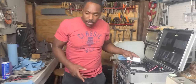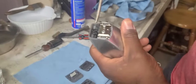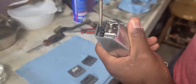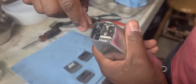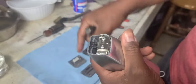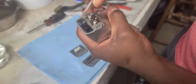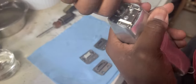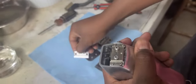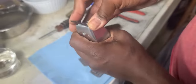All right. Now for your corded masters, you grab your masters, and always remember, whenever you're changing your master blade over time, the fork is supposed to be tight. Over time the pressure pushes these two together, but you want them to be separated slightly so that when you clip the blade in, it keeps that cutter stiff and strong while it vibrates. So you take your flathead screwdriver, you separate them slightly, just a little bit. Once they get separated slightly, now you can take the cutter and you slap it in on this side and then push, and it's a snap in.